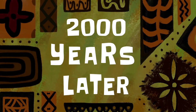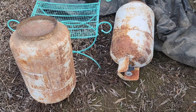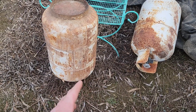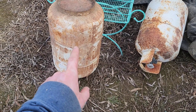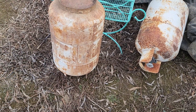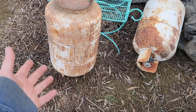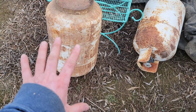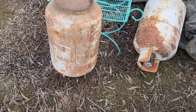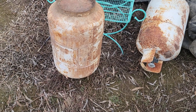I've literally had these in the backyard upside down like this for months now. Propane is heavier than air, so if you stick it upside down, the propane should go out the bottom and clear out the tank for you. It doesn't mean I'm going to consider it safe even though I filled it with water and left it upside down forever - I'm still going to take my precautions.